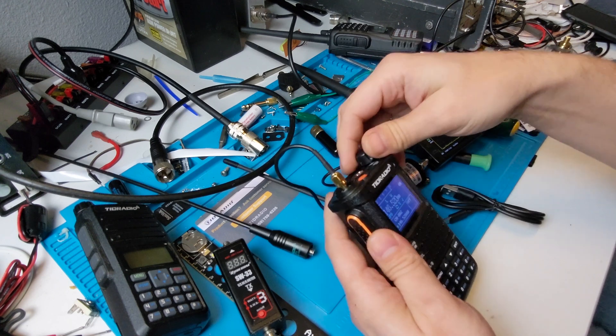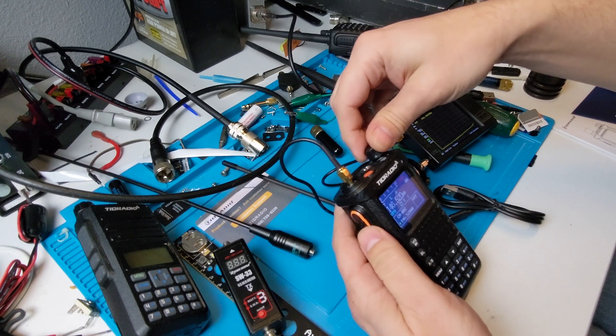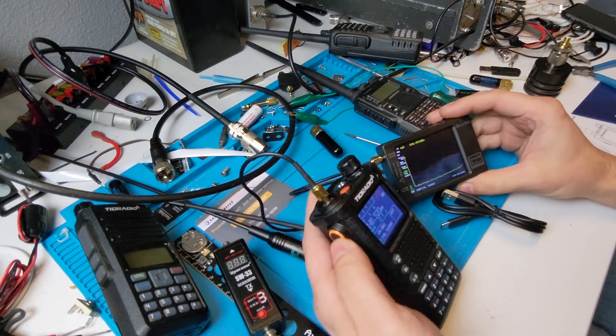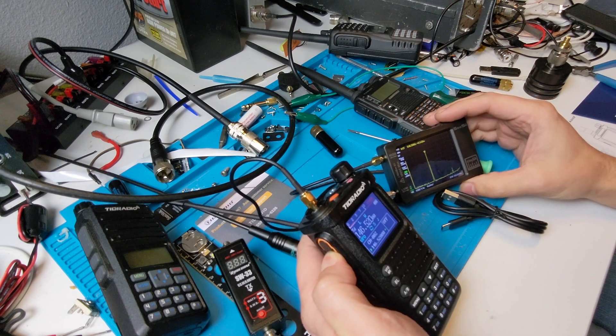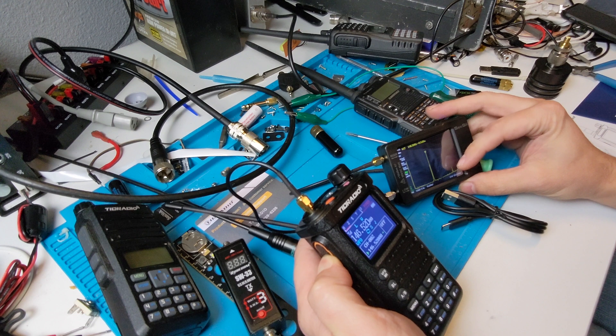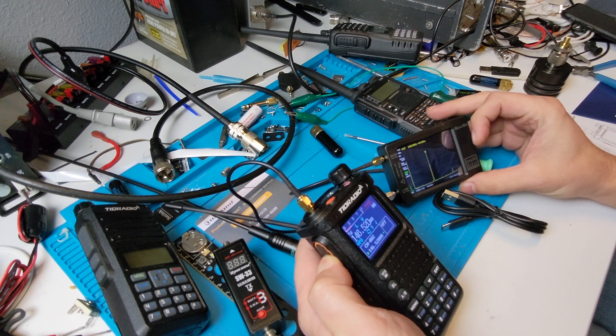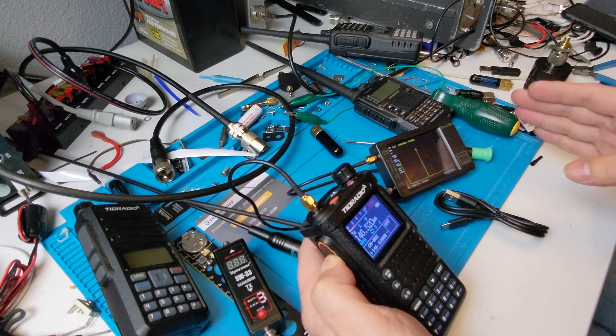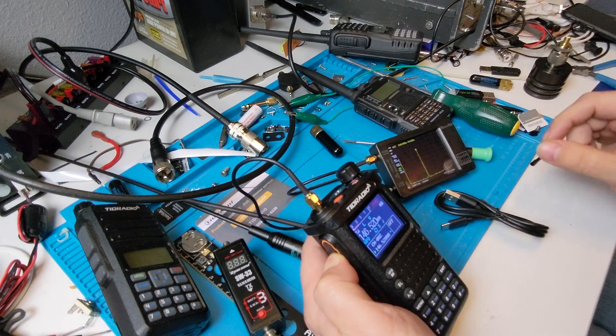It's got the cool guy voice, which seems to be improved in this version of the firmware — pretty decent. So that's negative 10 dB there through an attenuator, of course. And then that very next harmonic is way down here — negative 60-something dB. So well within spec, and I trust that the harmonics after that are probably going to get even smaller and smaller.